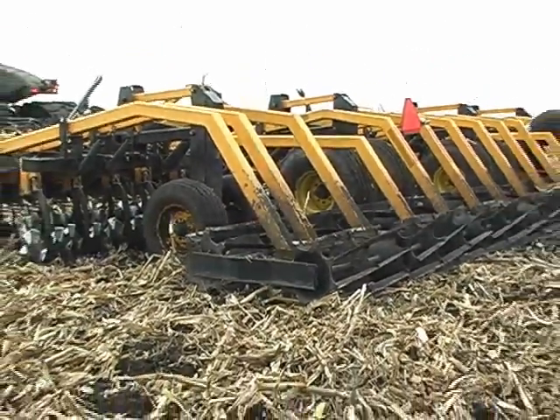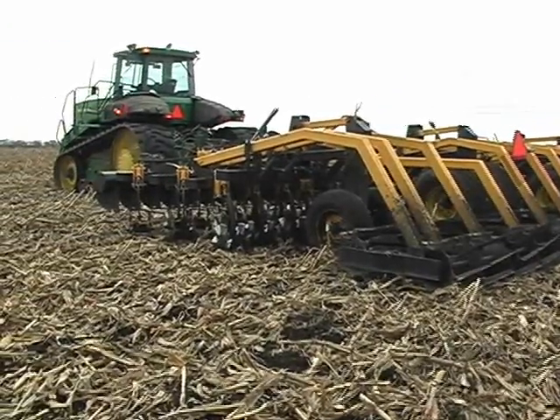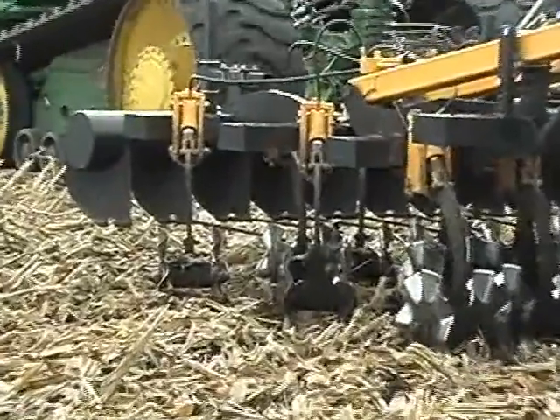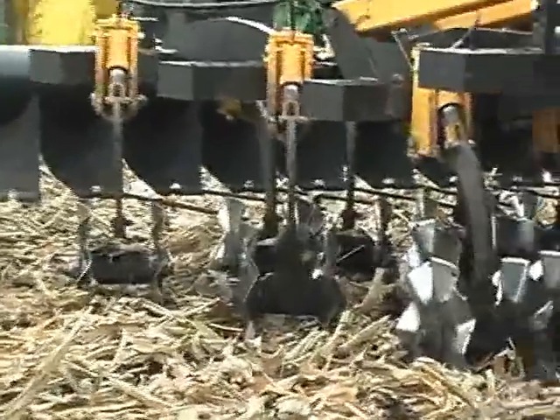The Trash Cutter is designed with three rows of wavy circular blades at 9 inch spacing per bar. Three bars will give you 3 inch spacing. The wavy discs will go through this straw in a circular motion. The blades are mounted on a caster for easy turning when the unit is still in the ground.